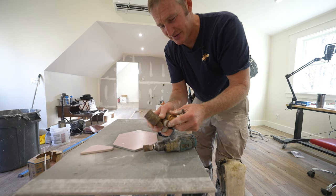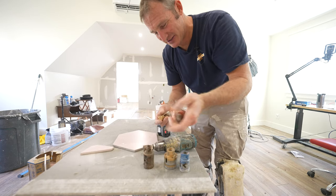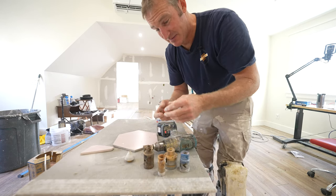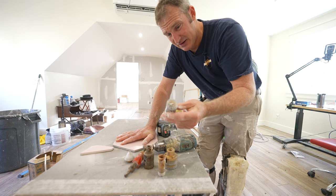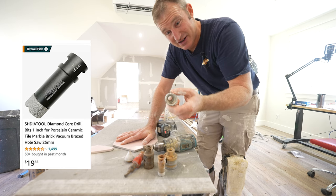When it comes to cutting holes in tile, there's all types of different blades out there. Some of them are going to last longer than others, some were definitely a lot cheaper than others. But for this 1/2-inch PEX, there's going to be plenty of room for the escutcheon plate, so I'll probably recommend using one that's on a grinder — that usually gets you the best cut.